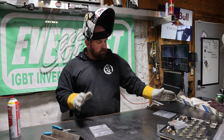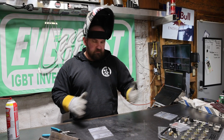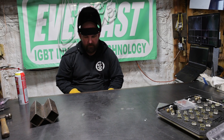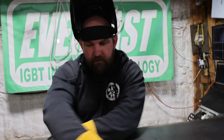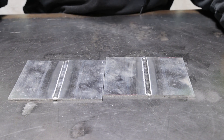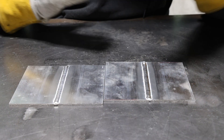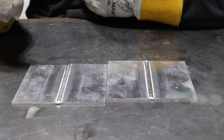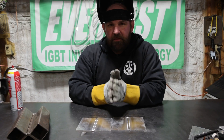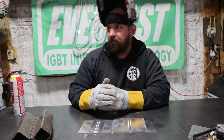We'll have the arc shot and then at the end we'll compare the two runs and show the similarities and differences. Here's our second run with totally different settings — you can see we still got a nice clean bead, it's got some shine, and the etching looks pretty much identical. So let's shuffle them around: which weld is which — the 1/8" tungsten versus 3/32", the standard cup versus the gas lens, the high frequency versus the lower frequency, high balance versus low balance? They are pretty much identical.